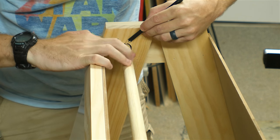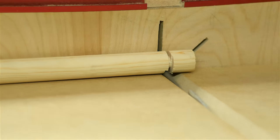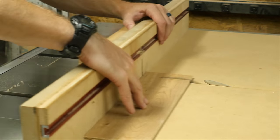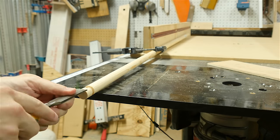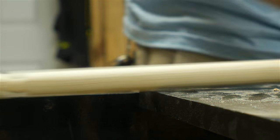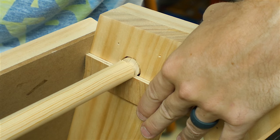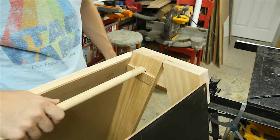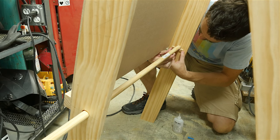I fed a dowel through the top two holes all the way to the outer bracket and made a mark on the area outside of the hole. Using the crosscut sled on my table saw, I lowered the blade and cut a dado into the dowel, then widened the dado just so it would be thicker than the material I was going to use for the lock. I cut down a piece of 1/8-inch material for the lock, then cut a key with a chisel on the end of the dowel. This allows the dowel to be locked in place unless you turn it to the specific location where it can lift over the lock. I tested moving the lock up and down to make sure it was tight enough to hold the dowel in place but not too tight to get it out. Once I found the best spot, I used some glue and brads to hold it there.